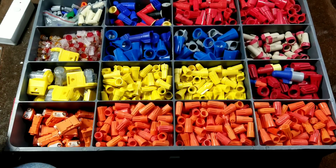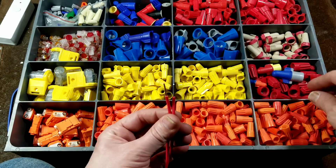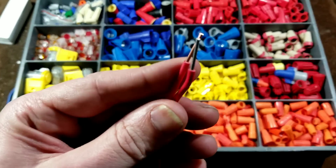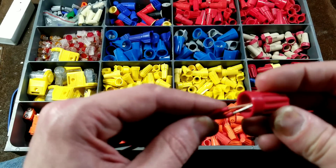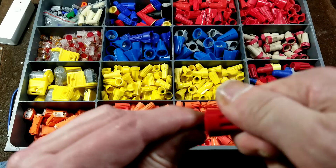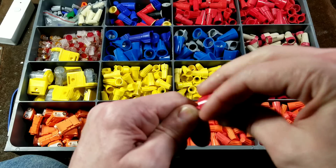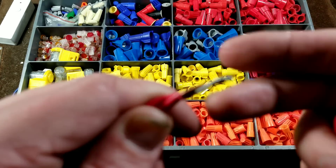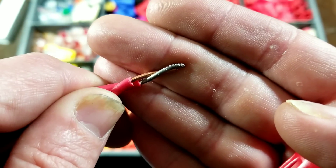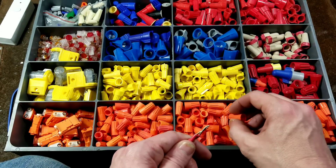To give a quick example — even though I did over-strip these wires — these are two 14-gauge solid core wires, the most common wire a homeowner doing any kind of maintenance would run into in the United States. I've seen so many times where people have used red wire nuts and they really don't work. You can see this wire nut — I can just keep turning it. It wants to cinch down but I'm just able to continue spinning it until it basically starts stripping out the back of the wire. That red is just going to be way too big. It's totally inappropriate.